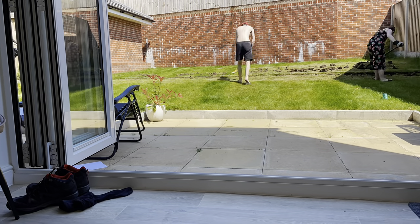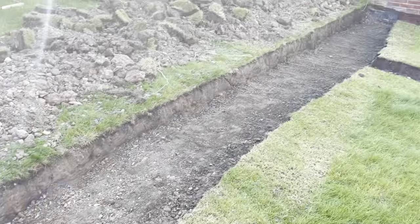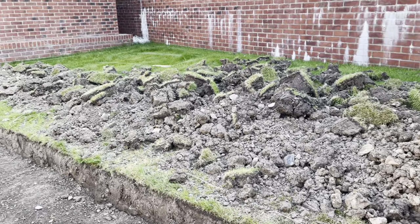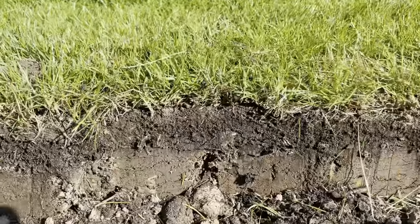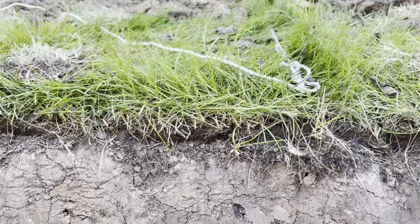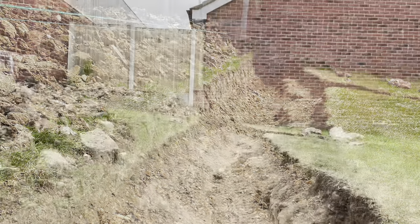By far the hardest part was digging the trench itself. I used a pick, a shovel, a couple of chisels, and a hammer drill just to get through all the slate, stones, and clay underneath my garden. I dug it quite wide to allow room for error and space to get the drill in when screwing the sleepers together. I also dug a trench down the front to gauge the level of the lawn, and then dug a trench within the main trench to fill with hardcore for drainage so the sleepers wouldn't be sat on soil and rotting away.